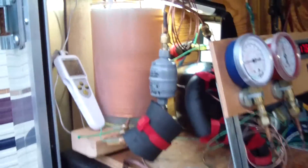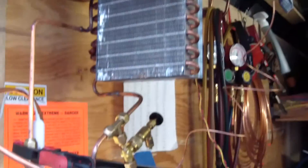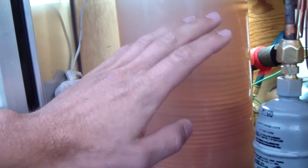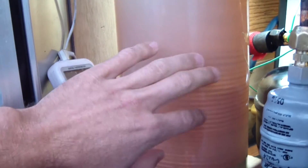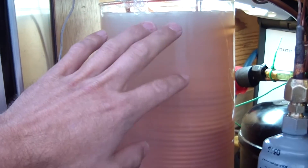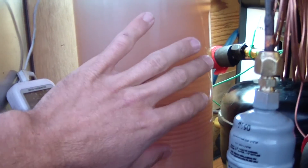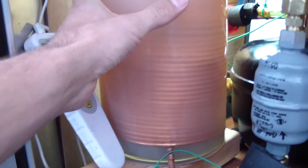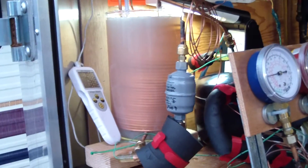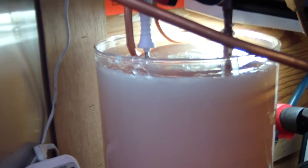The idea is to discharge all that heat into another phase change material that can slowly dissipate it over the next several hours until it re-solidifies and is ready for another cycle. At that point the compressor kicks on and melts all this paraffin. This is essentially petroleum jelly — vaseline. Try buying an eight-pound tub of petroleum jelly without getting funny looks. I ended up buying small tubs, melting it in a double boiler, and pouring it in.